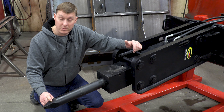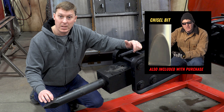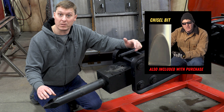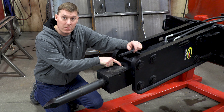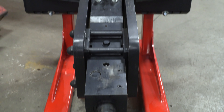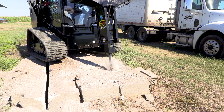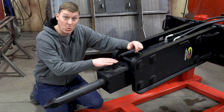We also, when you buy this unit, will be providing a chisel bit, which is just cut on two sides, and that will give a little bit faster production in materials that are maybe a little bit softer. If you go up to the body here, you'll see where the greaser area is. You'll notice that it's well protected — it's hidden down inside the body. That's important because things can fly up or maybe brush against this area, and you want to have that greaser hidden so it doesn't get broken.